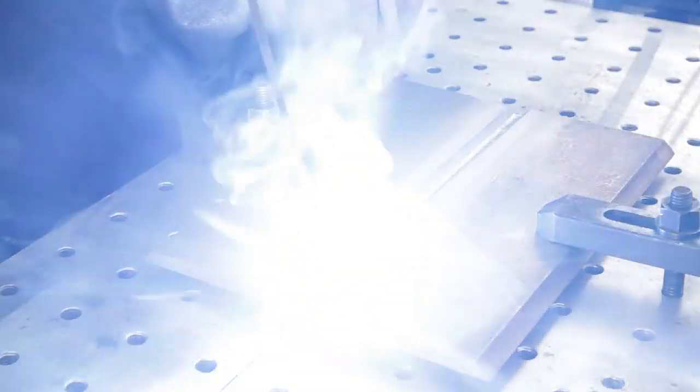Here we consider shielded metal arc welding. In this segment we'll be demonstrating the shielded metal arc welding process, also known as manual metal arc welding. The process is one of the oldest used in welding, even today. It uses covered electrodes, and is especially used in situations such as field welding where shielding gas might be blown away. It is an all-position process and produces very good welds.